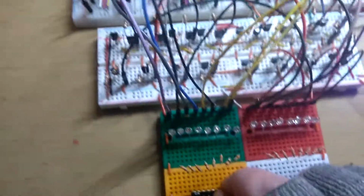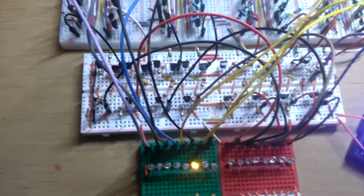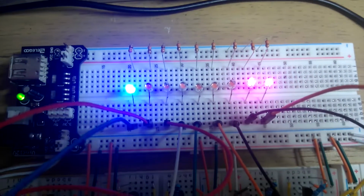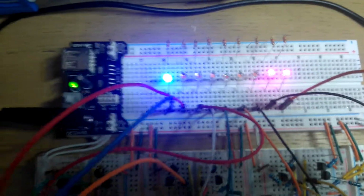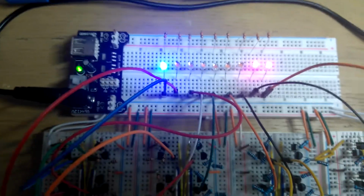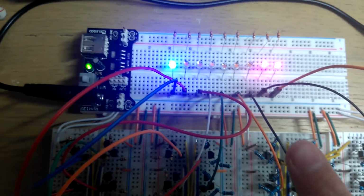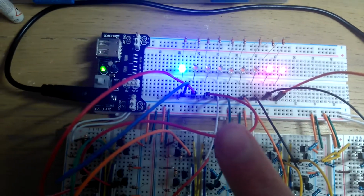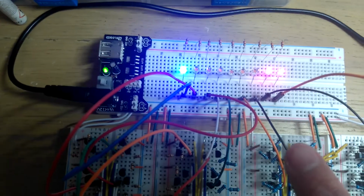So yeah, let's do some basic stuff. So let's do a 4 minus a 1. That should give us a 3, which, as you can see, it's got the 1-bit set and the 2-bit set. That means 3. And as you can see, this final carryout is lit up. Now, what this kind of means is that that's actually a positive number there. When that final carryout is not 1, that means you're actually into a negative number.